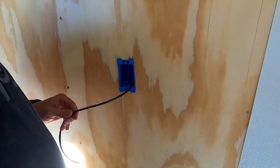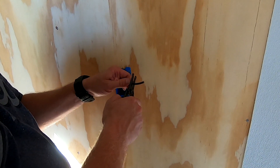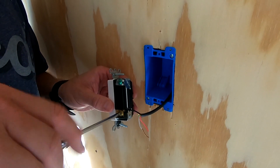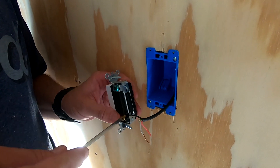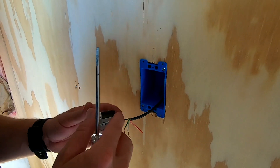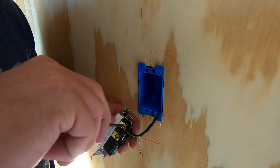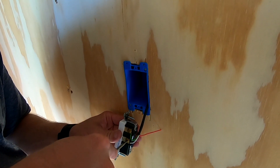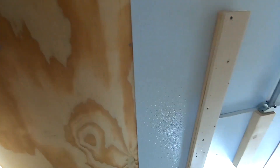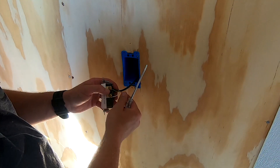I've got this box in and the wire run. I'll strip it off and show you how to make the switch connection. The black wire is our common wire, going to this terminal here. This switch is obviously meant for 120-volt AC but it's just a switch, so it'll work for a low-voltage application. We won't be using the ground terminal. I assumed green is down — we'll try that and reverse the switch if needed. We reversed it — easy enough. Just remember your orientation.